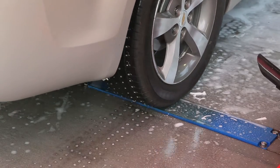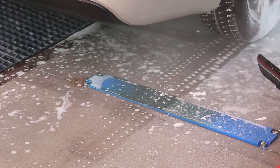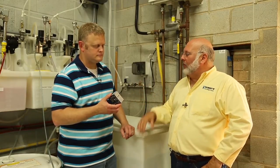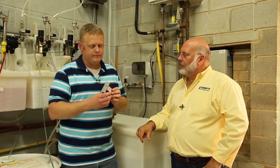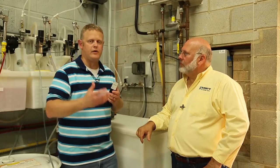When water is spraying and soap covers the front of the eyes, the amplifier increases the system power to see through everything in its path except the vehicle. This is a single channel automatic amplifier. This wash also has a 2-channel amplifier that controls the top brush auto retract. This unit is typically used for measuring the car and controls one set of photoeyes — it adjusts its power setting automatically. To tell which supply voltage you have, look at the silver sticker on the back that has the part number; the trailing end of the part number is the supply voltage. This one is a 24-volt AC amplifier. On the back you'll also notice four dip switches. For the single channel automatic, the recommended settings are: dip switch 1 up, 2 down, 3 up, and 4 down. The first two put it in the High 1 power setting. If you don't need the extra power, it runs on a lower setting which helps prolong the life of the components.